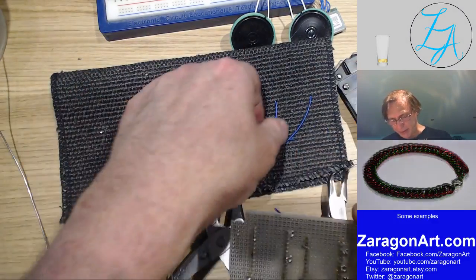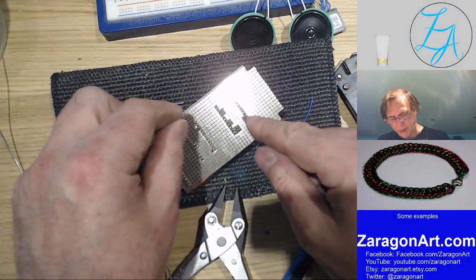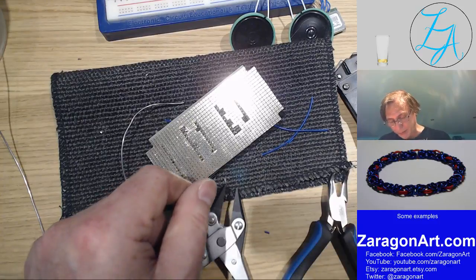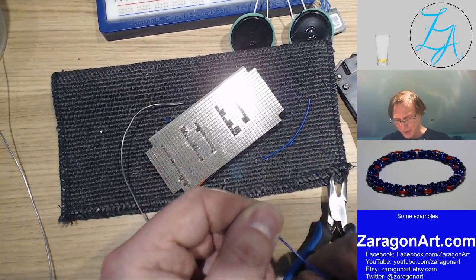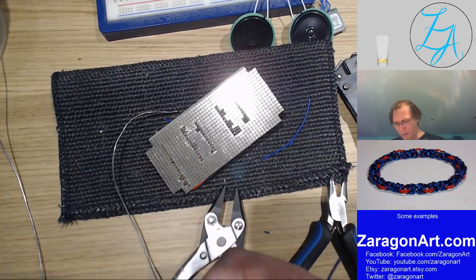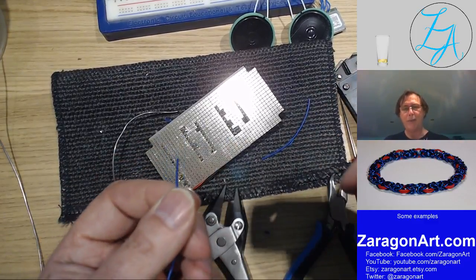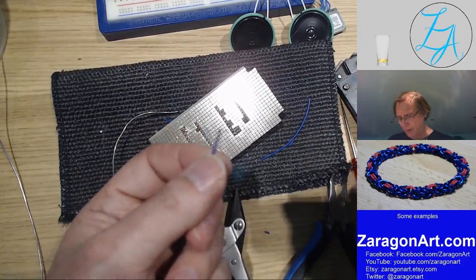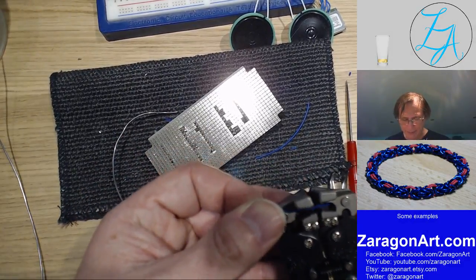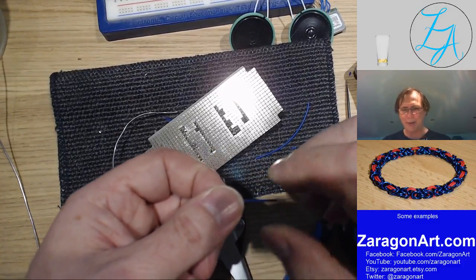I'm spending a little bit of time when I turn this over positioning it so that the wire doesn't move. I've got the wire exactly where I want it when I put the soldering iron on. But sometimes wires are reluctant, shall we say, to go where you want them to go. And it can get really frustrating. With something like helping hands, where it's clamped with a crocodile clip, it basically can't move. They're worth their weight. Whether they're worth their weight in gold, I don't know, but it depends on your point of view. Gold weighs a bit.